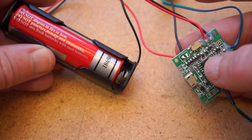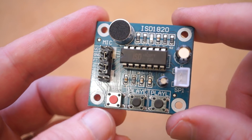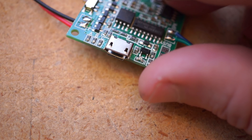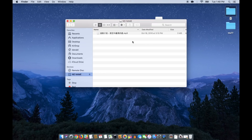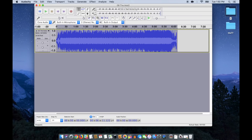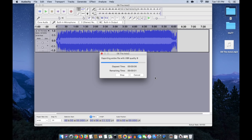Or you can also do what I did here and wire up a 3.7V rechargeable LiPo battery, or an 18650 battery, to the 3.7V connections here. Now, there are a lot of cheap voice recorder modules out there, and I plan on doing a separate video on why those are great, but what I like most about this board is that you also have a micro-USB connection where you can load up your own MP3 file. The board shows up on your computer like a thumb drive — mine came with a little song already loaded on it. Delete the demo file and load up your own, and now you have a button-triggered sound effect that you can fit in your project. You only get 4MB of room on here though, so if you want a long sound like a song, you'll need to lower the bitrate way down in a program like Audacity. I've done it before though, and it works.